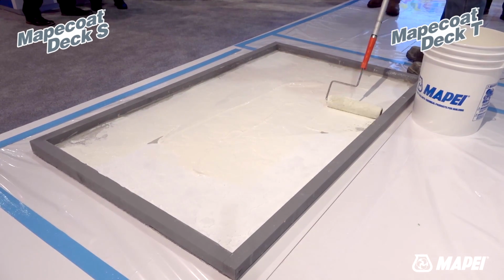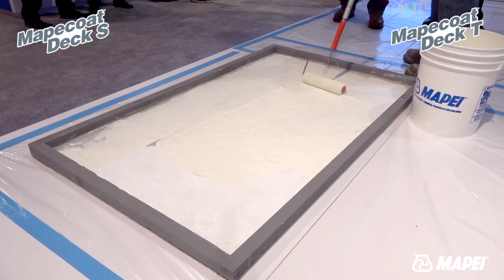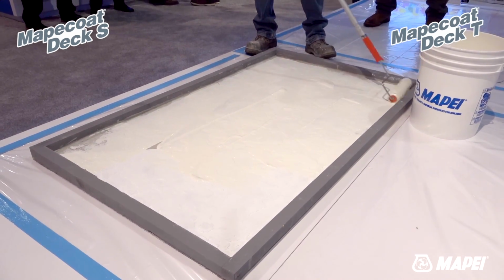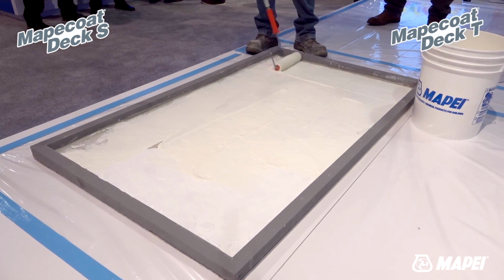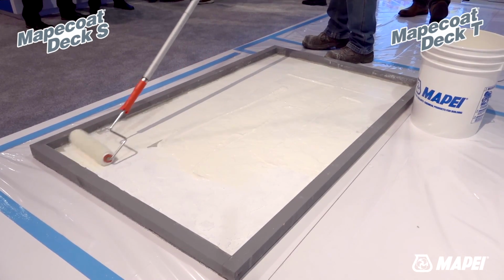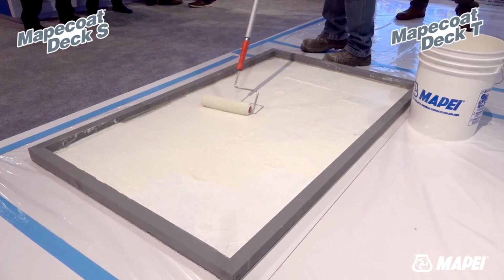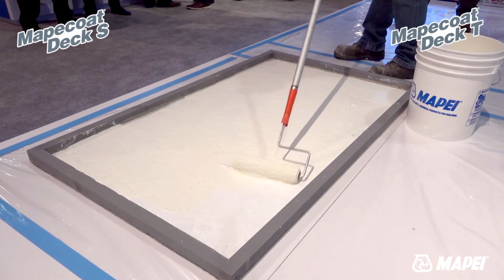It really is. But let's talk a little bit more about the product. A urethane acrylic, again, suitable for decks, balconies, walkways. It goes on slab on grade. So if you're concerned about vapor drive from the grade, we've got permeability here so it won't blister and lift off. Once again, it withstands hot tire pickup. So this would actually be quite good in your domestic garage.